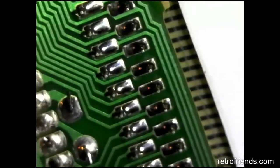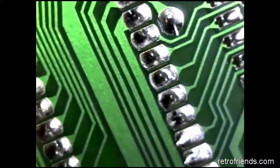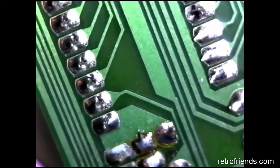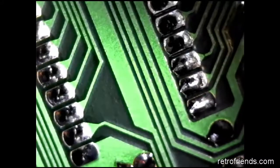I'm using a second flashlight to illuminate the pads at different angles so you can potentially see any cracks in the solder better. Here's another section of the keyboard processor chip. It's interesting the way those first three pins on the right have been bent over before soldering. This one here looks like it might have a crack — just going to continue scanning around for other trouble areas.